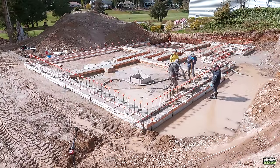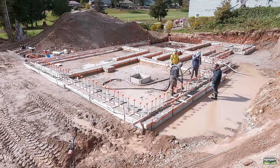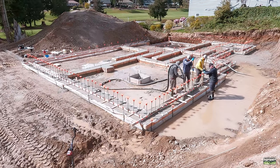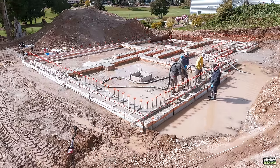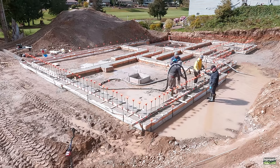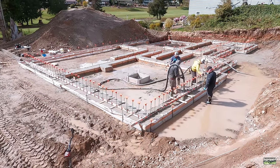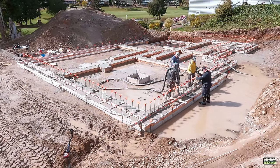Like I said, it's been stressful, so we just missed it. Earlier in the video, I even talked about doing a once around. I thought I had everything dialed in. I didn't. You can see that we have stakes about every 5 or 6 feet. Some people think that's the problem. It's not. The problem, as you'll see, is that I popped a spreader cleat. That also wasn't the problem. 2 of those 1x4s were not tacked to the forms. Had either of those situations been different, this would not have happened.